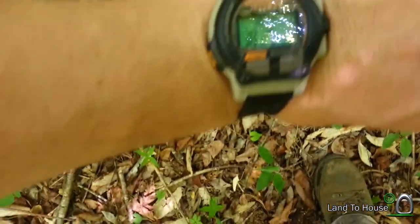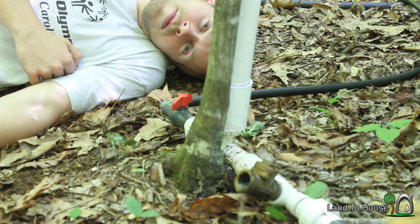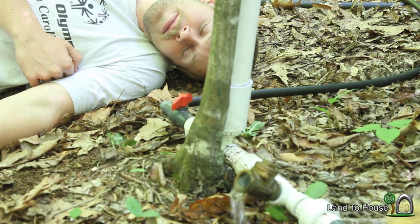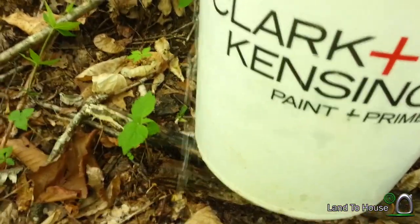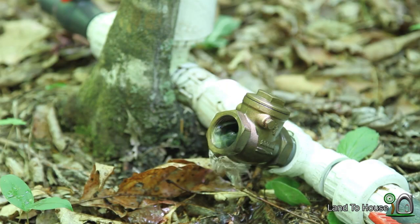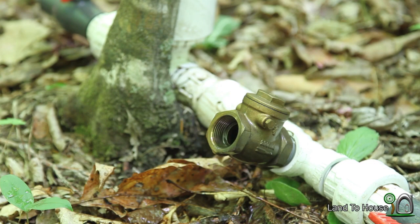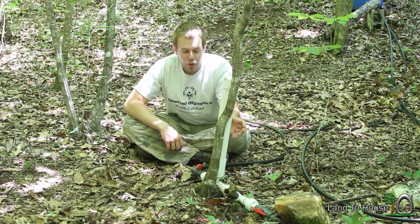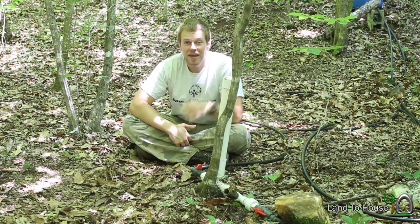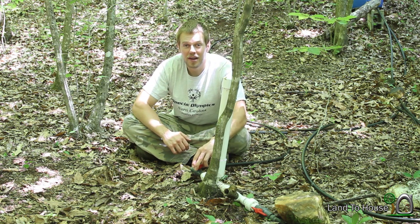At 38 and a half minutes — not bad, almost five gallons. Next time I'll use a smaller container of water. At 45 minutes. Our bucket started overflowing at 46, so we'll just call it like a half gallon more whenever this finishes pumping. This pump just beat my expectations. We had an output of roughly six gallons, because it ran longer than I was thinking it would. We consumed 55 gallons in 58 minutes, which means this used right at 0.95 gallons per minute — less than one.